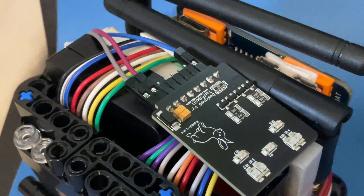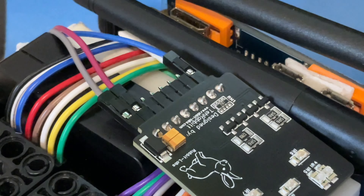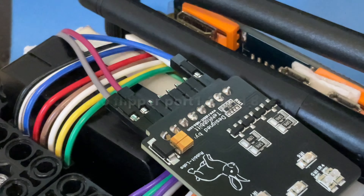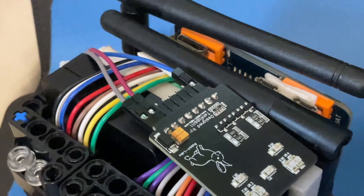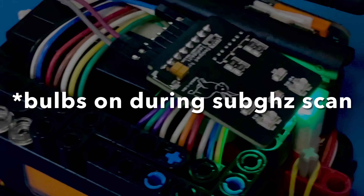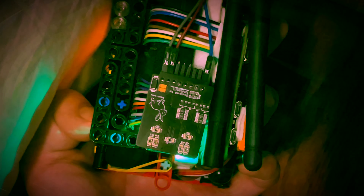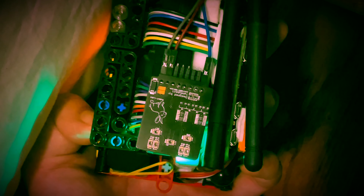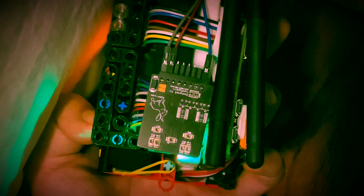The infrared blaster is a bit more straightforward, as you only need 3 of the 8 pins to make it work: pin 1, 2, and 8. These ports will also pass data and power to the IR blaster when I use any of the other Wankara functions, making it operate more than it needs to. A simple solution is to just unplug it since it's right under my nose. Don't worry, it does not break the loop — everything else still works fine with the IR unplugged.